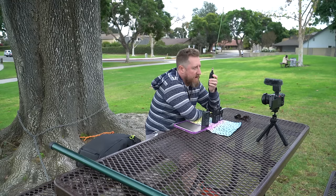So that is our test — we've tested all the radios with a little playing around the mic gain as well. Let's look at the numbers and hear my thoughts. I won't say I'm surprised by the results: all the best radios are relatively close to each other. When you're looking at 2 meters, these perform a little bit better, and that could be because of the Signal Stuff signal stick. Then you look at 70 centimeters — same order. What's really interesting is when you consider the audio quality between these radios. Personally, I found the received audio of the ICOM was punchier, and definitely when you included that mic gain it was just a louder radio — so while it is somewhat quieter on the signal-to-noise ratio on transmit, I think it's going to be a bit punchier.